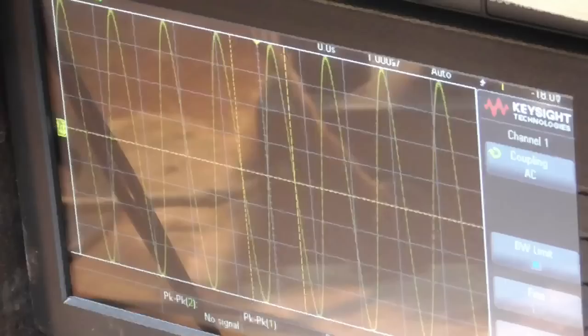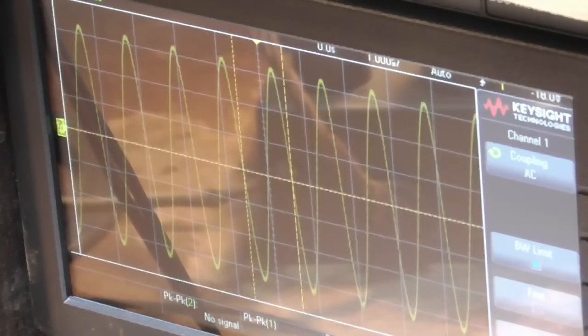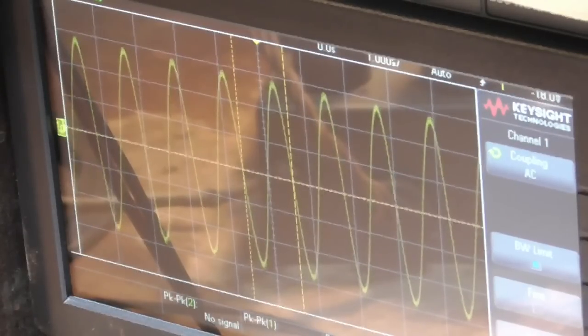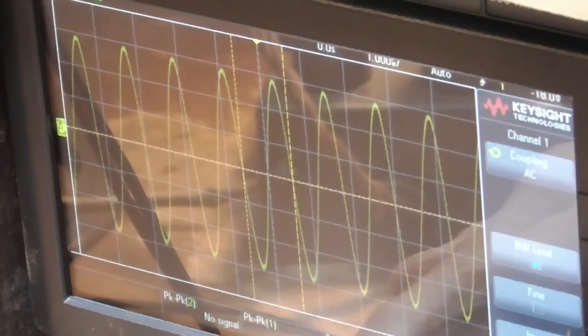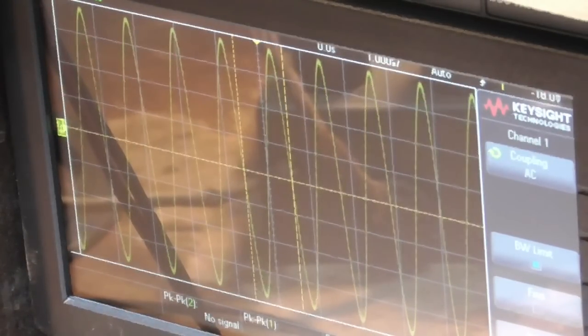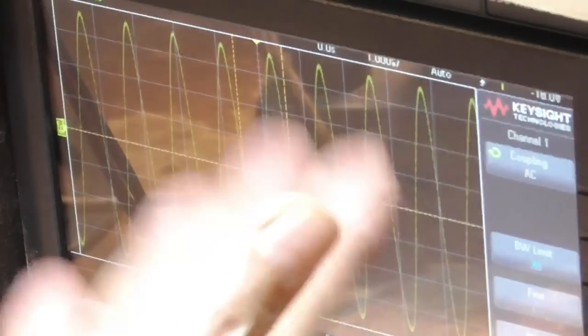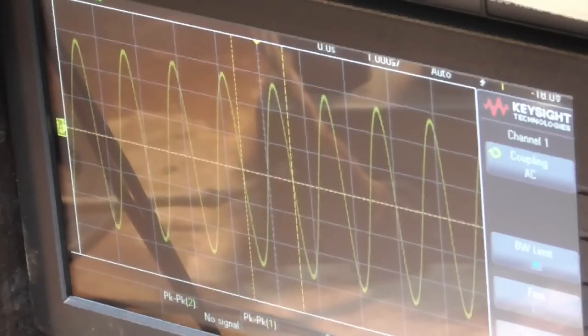If I start tuning up, now, at 1 megahertz, this is 1 megahertz here on the tuning dial. We should be reading an oscillator of 1455, 1 megahertz plus 455. We're reading 832. That's ridiculous. It's nowhere near. And when we go all the way up to 1700, it should be 2-something megahertz. We're only at 800 kilohertz, so the tuning condenser is having no effect whatsoever on the frequency.